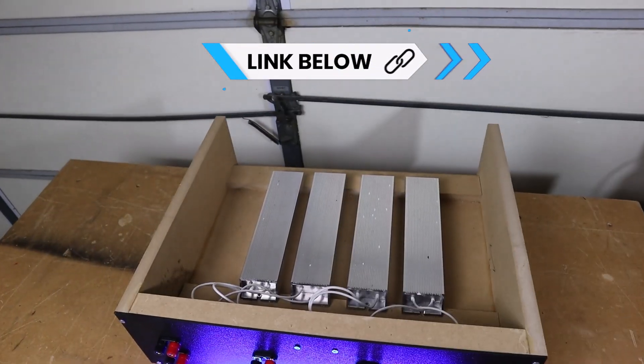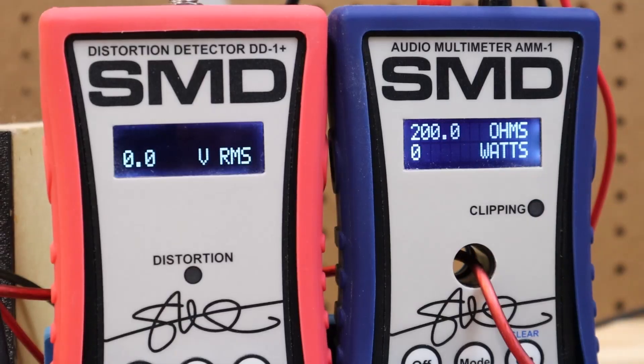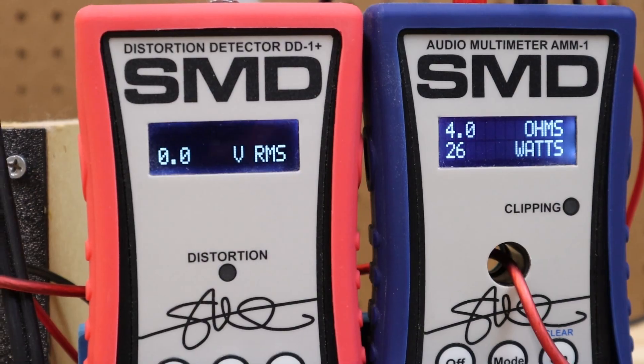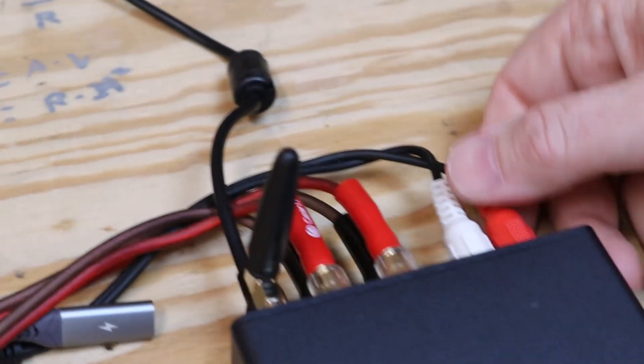To test this thing out, I'm going to hook up both channels to 4 ohm resistors and measure the power in watts using this handheld amp dyno and distortion detector. Cranking up the volume, we get 26 watts at full volume with no distortion — so it didn't hit anywhere near the 60 watts I was estimating. The issue is my telephone: I'm using a USB-C to audio adapter and plugging the phone into the RCA inputs. The phone just doesn't have enough voltage to drive the amp to its full potential. But honestly, no one's going to hook RCA's up to one of these amplifiers through their telephone — this is a Bluetooth amp, so let's connect to the Bluetooth and see what happens.